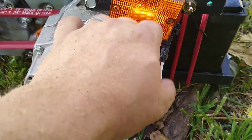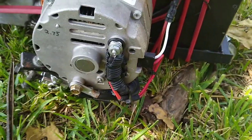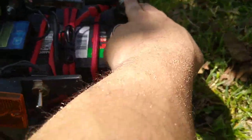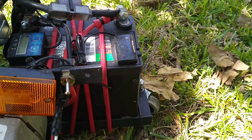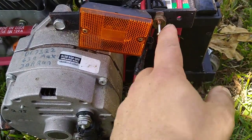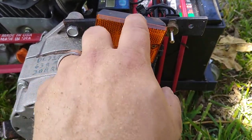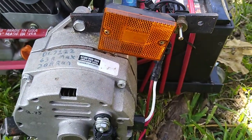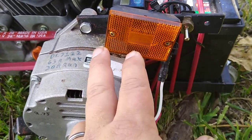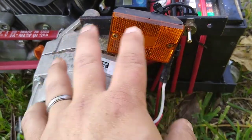When we start the engine, the light will go off by itself. That's turning the key off on the car. So this goes directly to the 12 volt of the battery. Another comes off of there, goes through, comes up to the side of the switch, through the switch, through the LED. This is an LED, so this works as both. Like if I used a regular light bulb, I'd have to put a diode and a light bulb. Since this is 12 volt LED, this is all I need. This works as a diode and the light bulb.